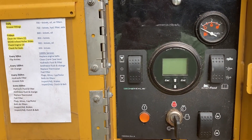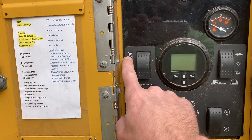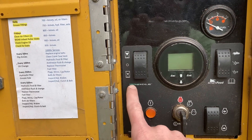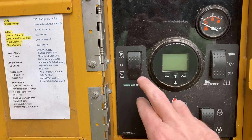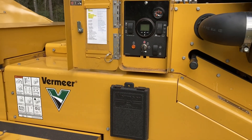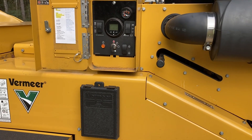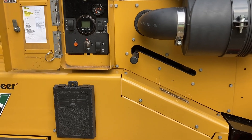If you keep it in the center, the machine runs continuous. On the up position there's a five-minute timer — you'll notice the hourglass is a little bigger than the small one, which is a one-minute timer. What that does is if you're in eco idle, after one minute of the engine not registering any droop value — meaning it's not chipping material — the machine will come down to an idle while still keeping the clutch engaged.